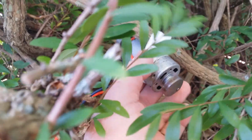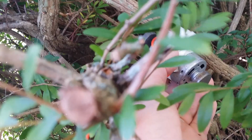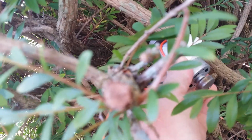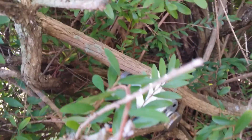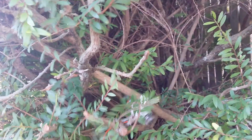And then you probably need to mount it relatively loosely in whatever you're trying to shake, so you can give it an actual chance to throw its weight around, so to speak. Otherwise, if you mount it too rigidly, I guess you probably won't get it. It's going to absorb the vibration too much. So I think that's not too bad.